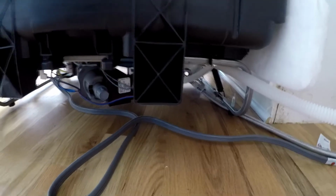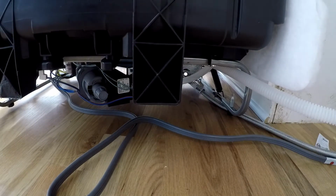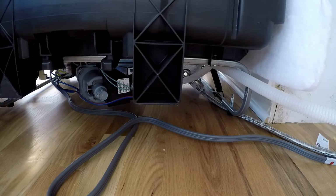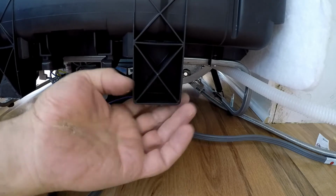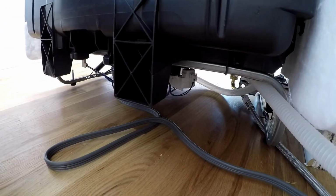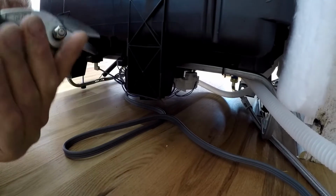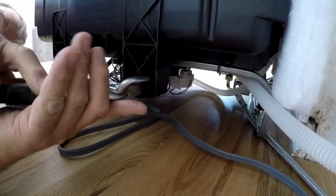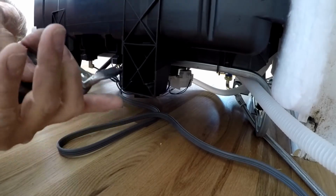Alright, so as luck would have it, that outlet box and this piece of plastic are interfering with each other. I've taken a look at the plastic, and it really does not serve any purpose other than to back up against the wall. So instead of spending an hour messing around with moving the outlet, I'm just going to take tin snips and cut this up a half an inch, and that will give me the room I need in a fraction of the time.